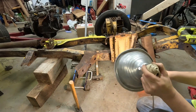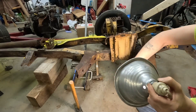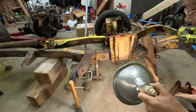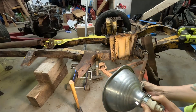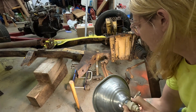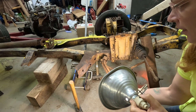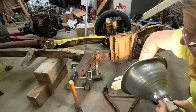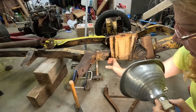Everything here is now gone because there is damage to the frame here. See this hole — this is where the lower arm mounts, and the way that it mounts is it goes through that hole and has a nut on the other side that makes it all good. The problem was this had blown out through the other side because there's a bushing through there to keep the frame.